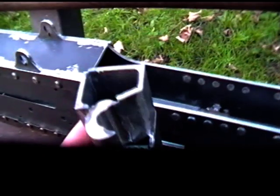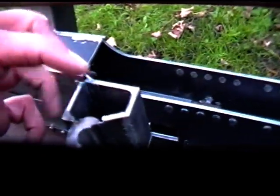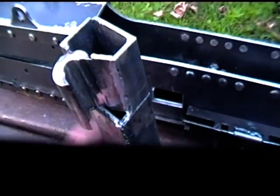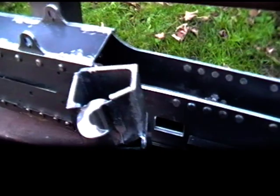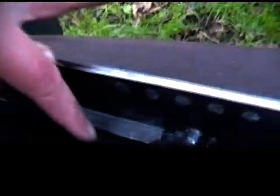Okay, the bolt's starting to take form now. So this is basically a 9mm blank firing bolt, which is being made up. As I say, it's two pieces of angle iron welded together, cut to size and welded so that the geometry fits into the rails which I've fitted inside the receiver. In here I've got my barrel mounted. Unfortunately the metal contracted a little bit when I was welding it and it's slightly deformed. If I ever made another one, hopefully I would get that a bit more correct.